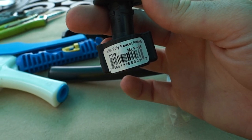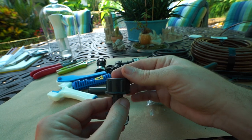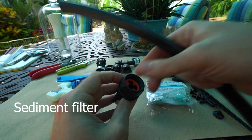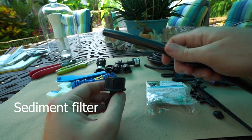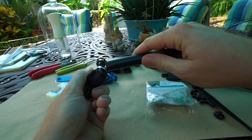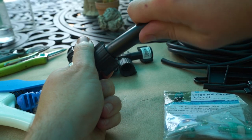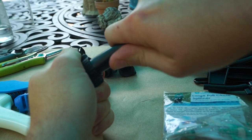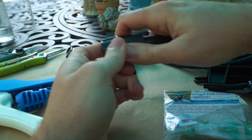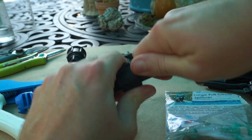If you live in an area with a lot of mineral deposits in your water, it may be a good idea to use a separate filter piece above the fitting. There are different screened materials and filters to help keep large deposits from going through, because the drip emitters have tiny little holes that clog up very easily. With the half-inch tubing, you push it in nice and tight as far as you can, and then you thread this piece down and screw it in to hold it in place securely.